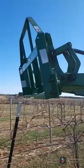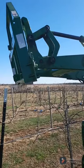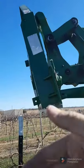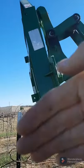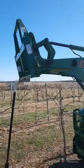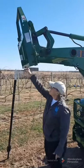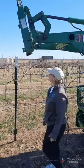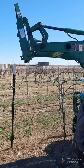I've flipped the camera around here to show you our loader. Typically when you push in a T-post using a loader, the problem is that it's going to run at an angle in a partial circle because it's working on a fulcrum. When you're pushing in a T-post with the loader, what you end up with is actually pushing that T-post in at an angle as well. Cindy can point up there to the loader — we typically center that loader right over that T-post and push it in.